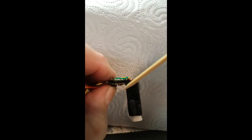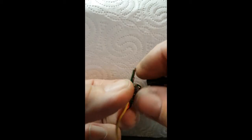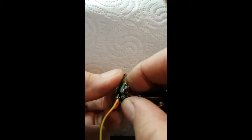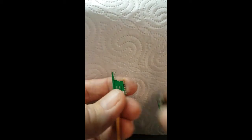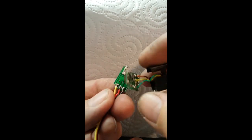To do that you have to desolder these pins here, so I just turn them upside down, heat it up, and then use air to blow out the solder. Once that's apart, then that thing comes apart pretty good. Get that apart and then you can get to the servo cable.